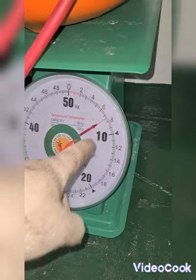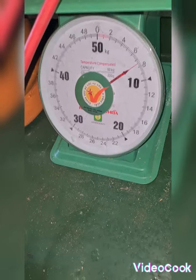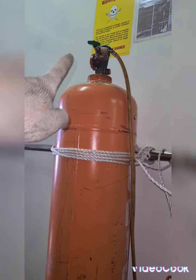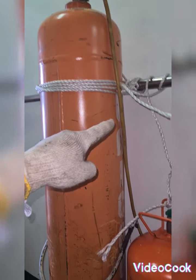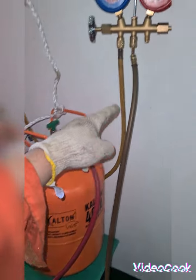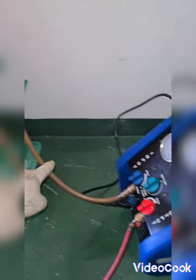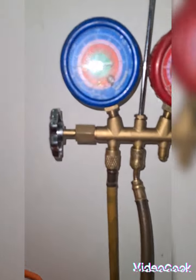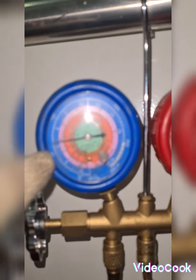The weight moves from 7.4kg. The weight of the small bottle is now about 10.9kg to 11kg. This valve from the big 45kg tank is connected with gauge manifold hoses going to my gauge manifold inlet side, and then to the recovery pump inlet side. The output is connected to the small tank. As you observe, before it had 10.2 bar, now I have 4.4 bar.